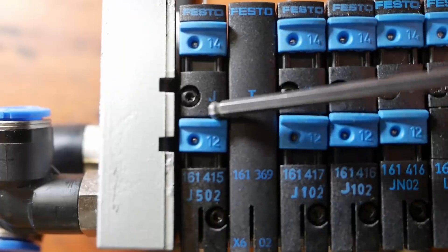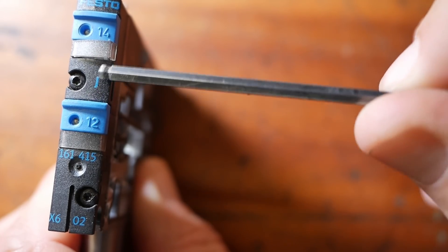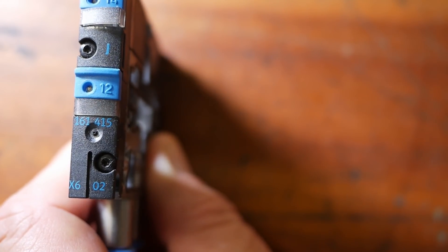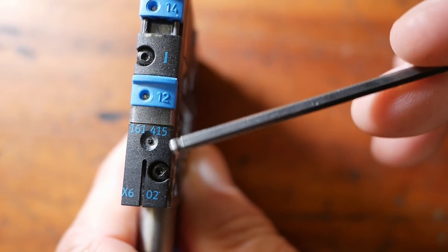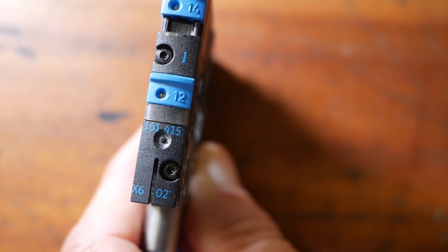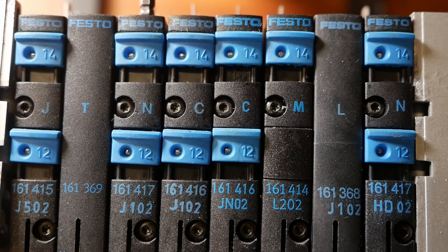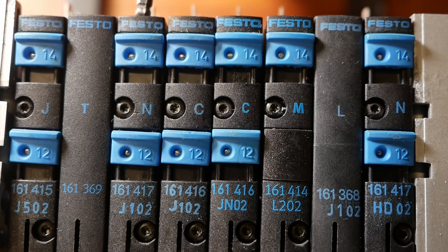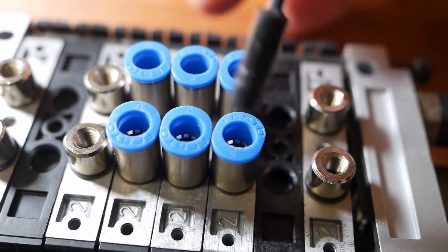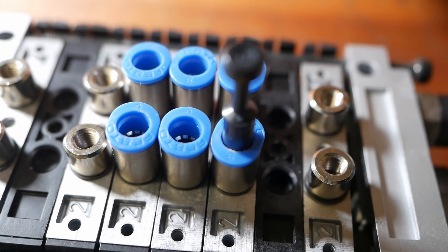I thought I only had one type J valve because I had a bunch of these, but this looked to me like it was an I — the hook's really small. However, a couple of eagle-eyed viewers have pointed out that the type J has a part number ending with 415, and the ones I thought were I's also have part number 415, so they're type J's. Now it was also pointed out that instead of using a type H in this position I can also use a type J, and the same for my tailstock. So I've basically got all of the valves that I need — I'll just replace those two, and I've also got a bunch of blanking plugs, so I can use any old valves and blank them rather than the type L blanking plates.